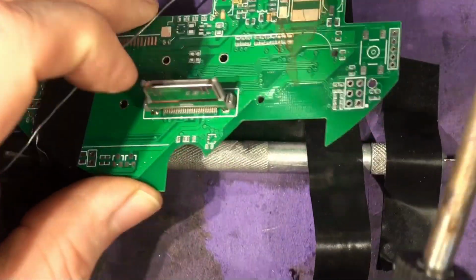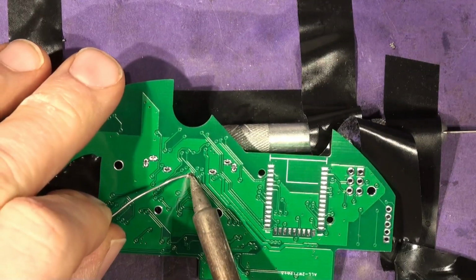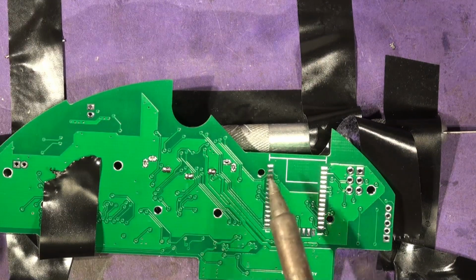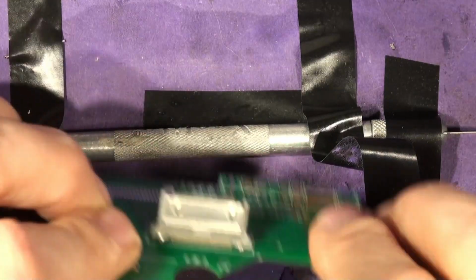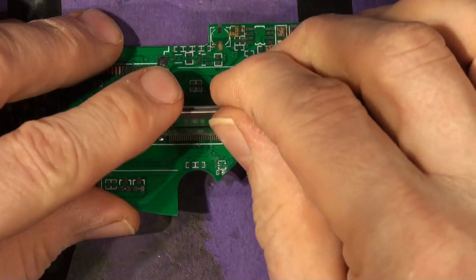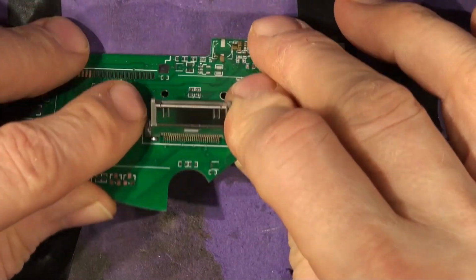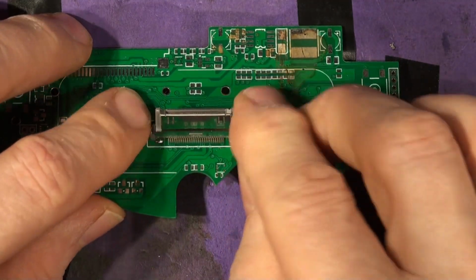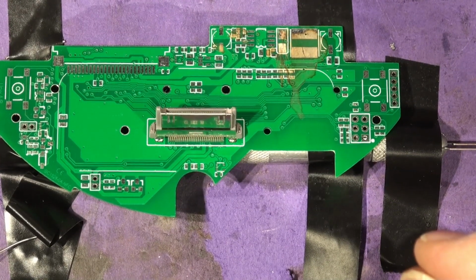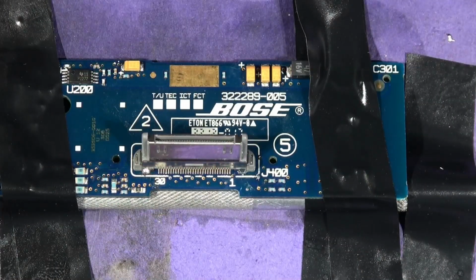And then turn it over and just solder the back pins as well. You go around these one at a time and solder them in. I won't bother doing them all. But that's a step I missed out on the other board because, like a twit, I forgot to press the record button. So now the connector's sitting down, all the pins are in contact with the board. Inspect it carefully before you go any further, because if these pins aren't sitting down on the pads, it will make it more difficult for you. Make sure it's lined up in X and Y. Anyway, that's that stage, and now we're going back to the original board, because that's the bit where I forgot to press the record button. Still subscribe to me though, don't treat me badly. Right, are you sitting comfortably?